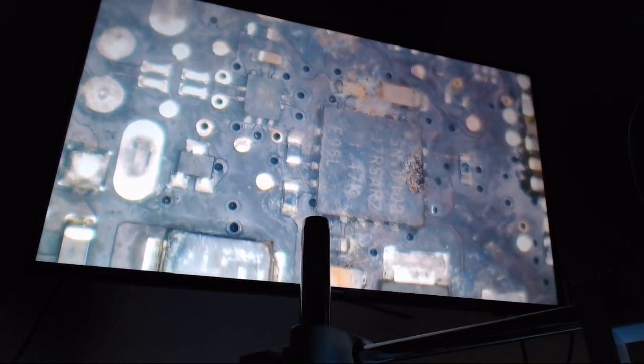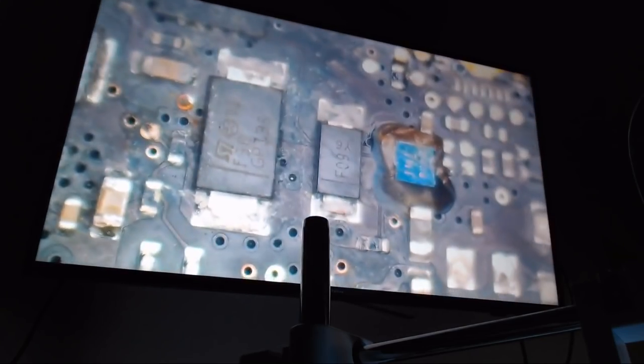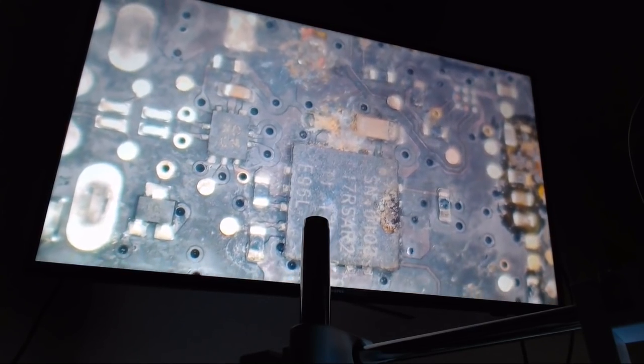So if we go over to the next board, which was in the Crest Ultrasonic Cleaner, and if you remember, the corrosion was a little bit stronger on the board that went in the SharperTek. So here's this one, same board. We're gonna go over here, and you see there has been a considerable amount of corrosion left in this area. Keep in mind, both of these solutions were 115 milliliters of Branson EC. That's where the old ISL was, and here is the other chip. There was definitely more corrosion left on here. I'm going to have a before and after of both boards as well at the end, so you guys can compare them and decide for yourself. But with the amount of corrosion that's left on this board, I can safely say that the SharperTek won this battle for sure, in cleaning performance, that is, because there is significantly more corrosion left on this board.